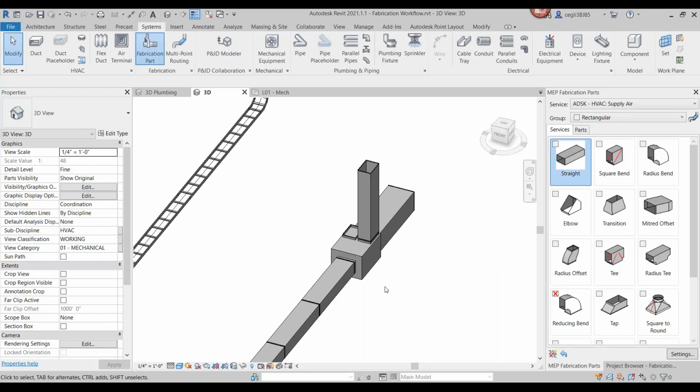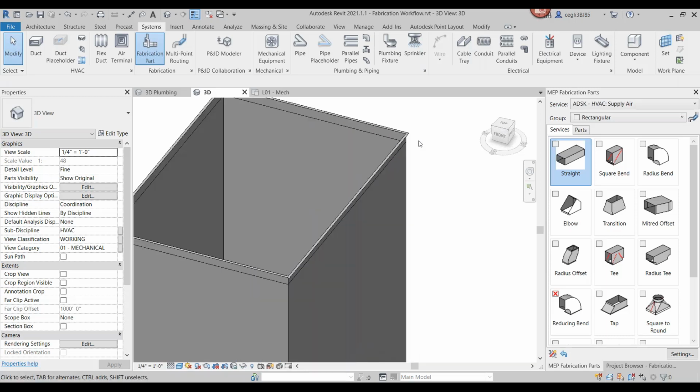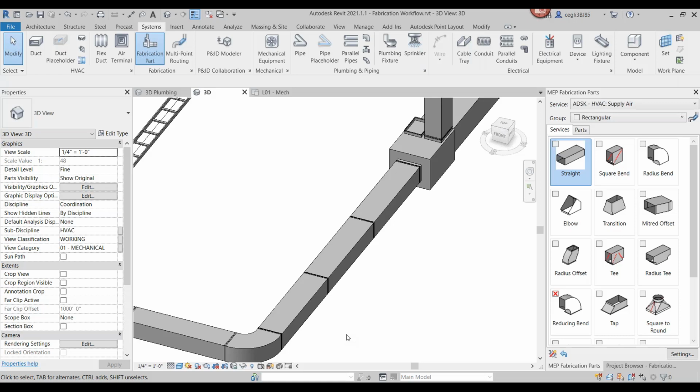You've seen this kind of thing before that we can do in straight up Revit out of the box. Now, LOD 200, LOD 400 or 350, that sort of thing, there's quite a bit of difference here. Like if I zoom in massively close on one of these ducts, I'm looking right down inside of it. And what I'm seeing here is the margin area for the seam allowance on the top there to accommodate the bend is showing up as well. So that sort of thing takes place, like with pipe, for example. Some of them are welded end to end, some of them are slip in. And if you're going to get accurate lengths for your pipe, you're going to have to make sure that it accommodates the threaded end prep and such on it.